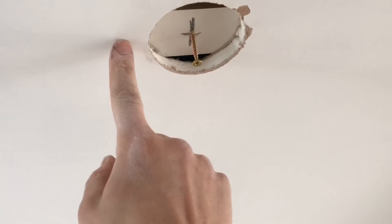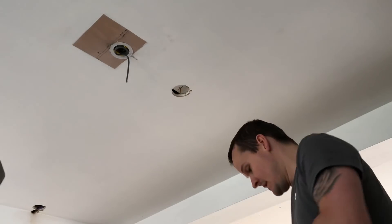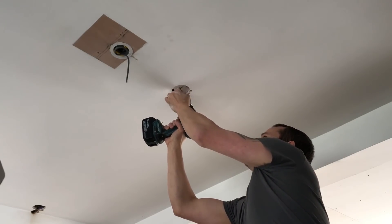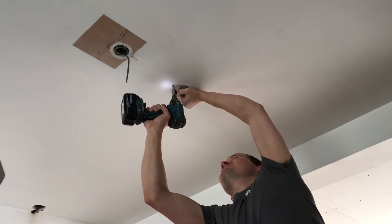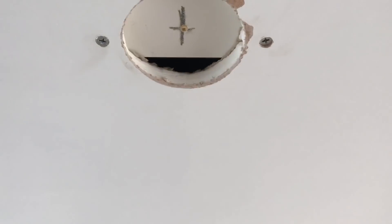Next thing, bring your piece of timber over to your hole. Get it up into the hole, and you know that screw is now sat there — you're going to have an inch overhang here and an inch overhang here. Position this screw so it's roughly centre of the timber. Then using some silver plasterboard screws, either side of the hole, pull the timber down and screw that up until it just goes into the plasterboard. Do the same on the other side. Piece of timber fixed with two screws either side, then take this centre screw out — that was just your handle to hold onto that piece of timber.